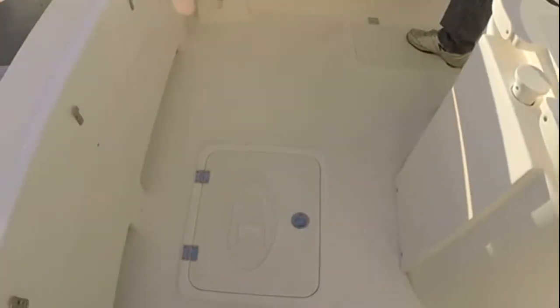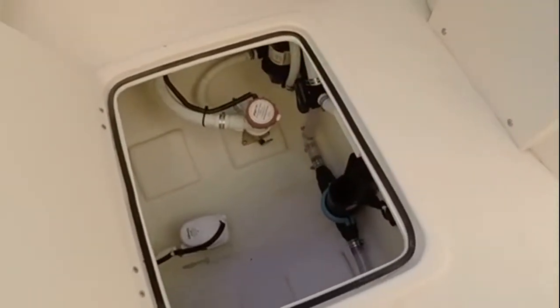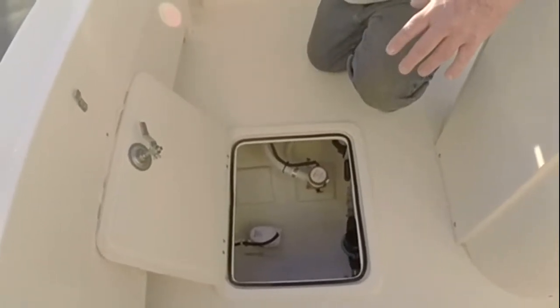They are plumbed to a gulper style pump, or diaphragm style if you prefer, so you can switch from port to starboard. The reason we use the gulper or diaphragm style pump is that if a fish hook or a sinker were to go through it, it won't wipe it out, like a conventional circular impeller pump.